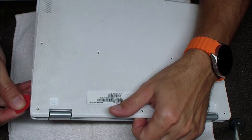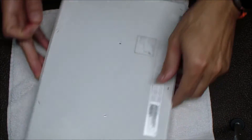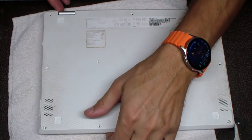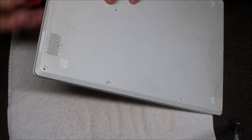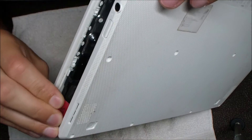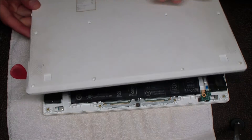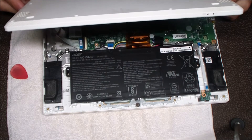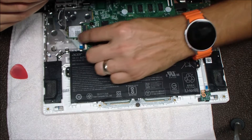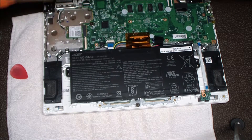You want to be careful with this one. It's got a cable connector that's connected to the bottom cover, so if you were to just take off that cover and rip it out, you'd rip off one of the cables. It's a little I.O. board that has a cable clipped into the motherboard. So don't just go and take the bottom panel off — make sure you're careful once you get it undone. I'm just taking my fingernail and popping it up, flipping it up. It's a flip-up, flip-down lock connection — just detaching that cable.